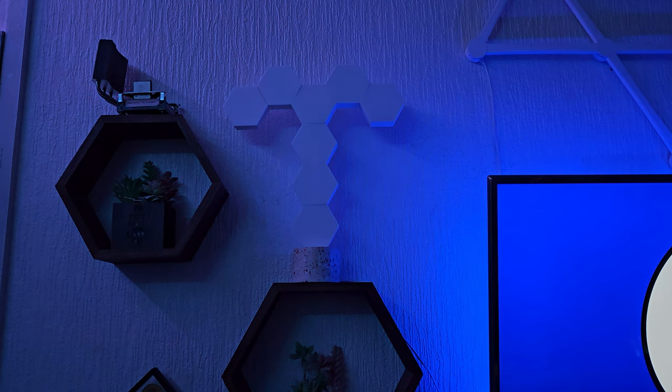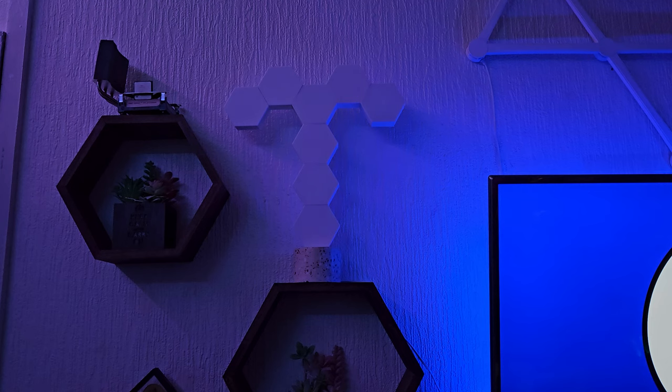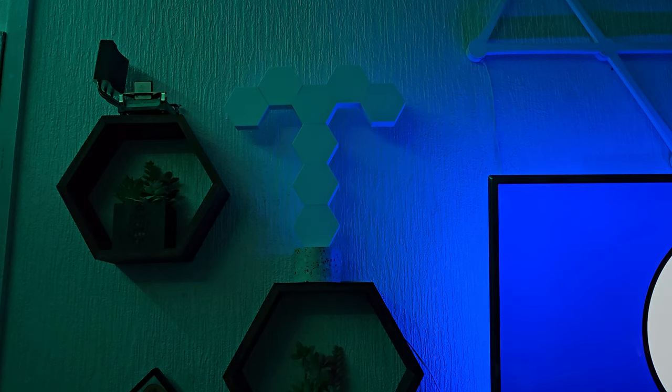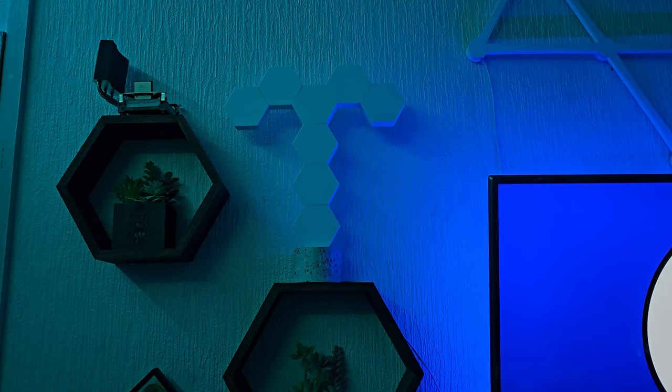It's probably just better to show you guys, and I can explain. In defense of Colo Light here, I saw a video last week where a guy had used a different power supply for these, and he got crashes as well. And then after reading, the instructions clearly say, and I just did see this in the app, it actually did tell me in the app as well, but I ignored it. It said, make sure you're using a 2-amp outlet or you may get crashes and issues.